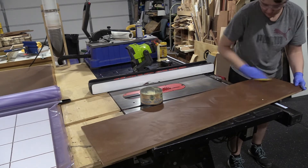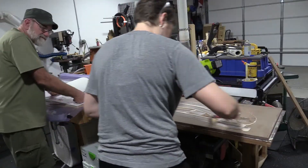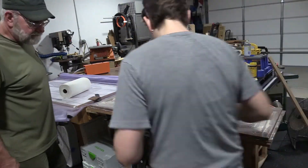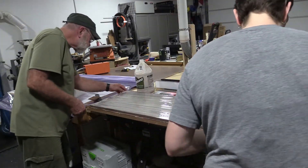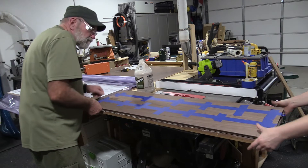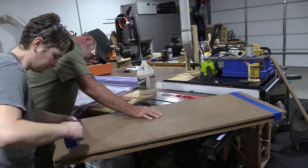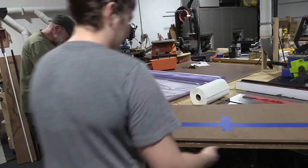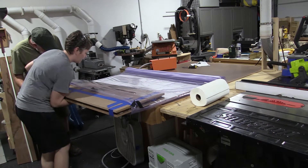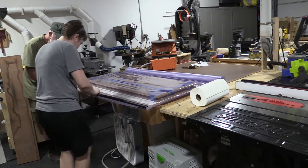It's also smart to round over the corners a little bit just to help save your bag. These also must be waxed so that the glue doesn't stick to the culls. I used Titebond cold press glue and it was much thinner than regular wood glue so there was definitely a learning curve getting it applied evenly. The little craft roller worked pretty well but probably a four-to-six inch rubber roller would have worked even better. I applied the veneer to both the top and the bottom of the door just to make sure nothing would warp. I taped it together to make sure nothing would shift while putting it into the bag. The hose for the vacuum press is put in from underneath into that board, and that's why all those channels are cut into it, so that air will be able to evenly distribute. Once I got it in place I locked the bag shut and let the press do all the rest of the work.